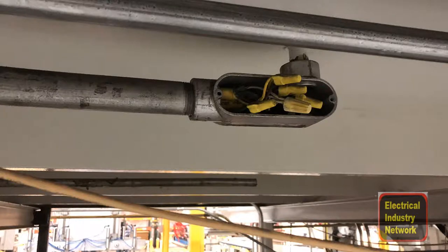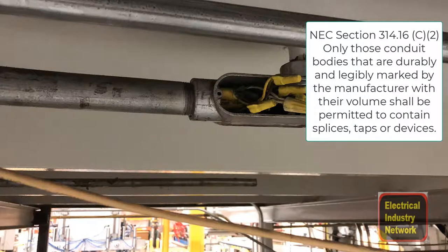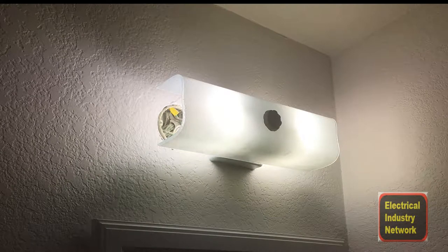On this one here, what they did was use an LB going into a piece of equipment. I think what happened was the piece of equipment had short little leads coming off of it. You're not allowed to wire-nut inside an LB unless it's got the volume marked on it — and I've never seen them like that; they could exist, I'm not 100% sure. But using wire nuts inside an LB is not legal. You should probably use a bell box or something similar. I think they used an LB just because it was the fitting they could get in there and make work. They could have just used a four-square box. Don't wire-nut your wires in an LB.